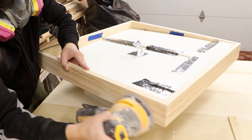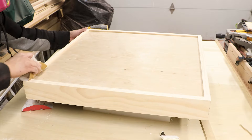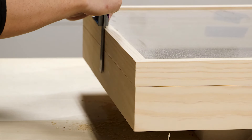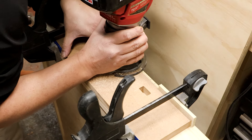For the final prep before finishing, I'm using an orbital sander with 400 grit to smooth out any imperfections. I measure the latch and hardware, CNC the template out of MDF, then flush-rout a pocket for the latch to install.